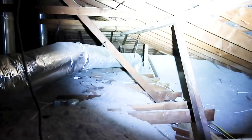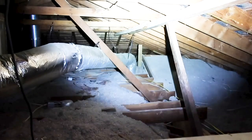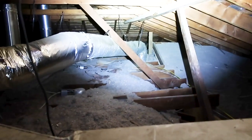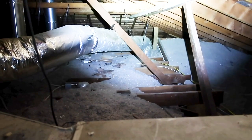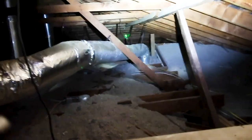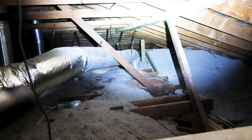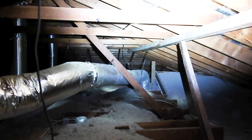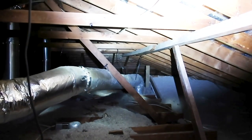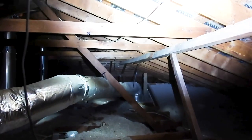Eating my words a little bit — you can see where the dip is across the purlin support here. Using my laser pointer, right here you can see the dip and where the purlin is falling loose over there. So this isn't properly supported anymore, and that's the reason why you're getting that sag across the roof line. It is something worth reporting — at a minimum, reinstall the purlins so they're properly installed.